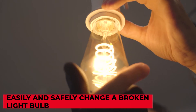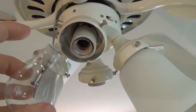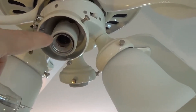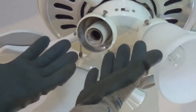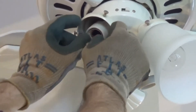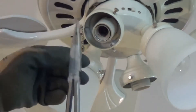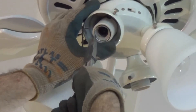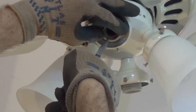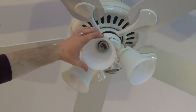Here's how to easily and safely change a broken lightbulb. Broken lightbulbs are particularly troublesome when they break in the socket, because all that's left to hold is brittle broken glass, making unscrewing the small nubbin nearly impossible. Begin by using a metal tool to remove as many shattered pieces and dust as possible. Then insert a replacement bulb into the socket by turning it in the opposite direction — this should catch and unscrew the old component, allowing it to be removed. The procedure also removes all broken components, leaving the socket functional and ready for the new lightbulb.